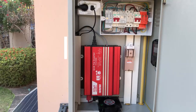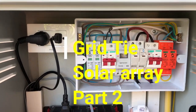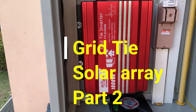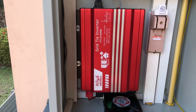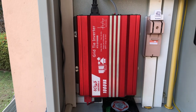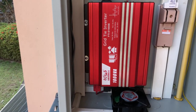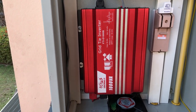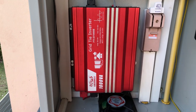Hello there from Thailand. This video is going to show you how this fuse board for my solar panel works. Basically this is a grid-tie inverter, which links up to the grid. Having a grid-tie system means if the power goes off, the grid-tie inverter stops putting power to the grid if you're not using all the power in your household, so any linesman or anybody working on the electrical installations on the lines is protected — it's a safety feature.